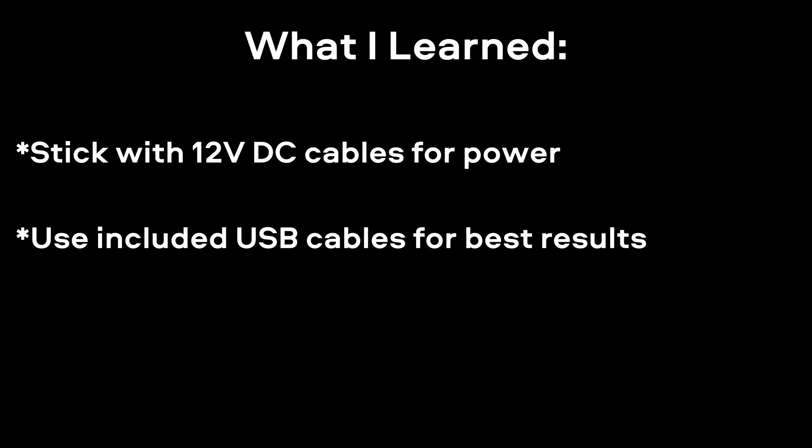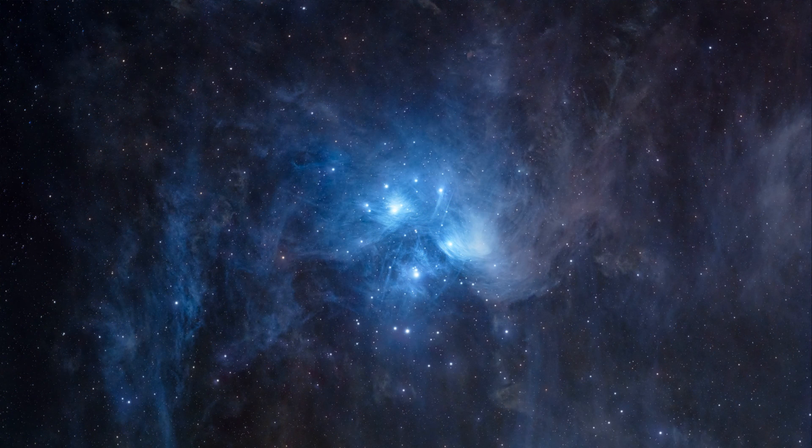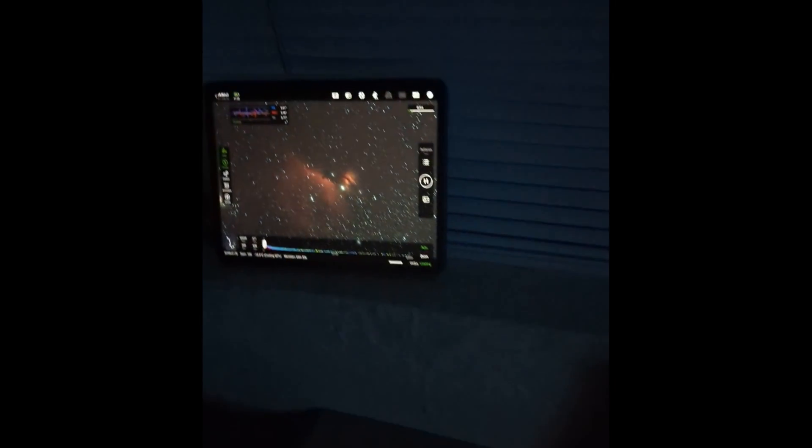So my final advice: if you're still fairly new to astrophotography, try to get at least four hours on your target, even if that takes two or three nights to accomplish. More is always better, but that's a topic for a separate video. The big takeaway for me was swapping out AC adapters for straight 12V DC cables — that should give you much better results. Also make sure your USB 3.0 cables are legitimate and from the manufacturer so you know they work as intended. If you're still noticing problems, try swapping the cable out. And if you want to make your life easier and can afford it, consider getting the AM5, ASI Air, a dedicated astro camera, and a telescope — with a little practice you'll get vastly improved images over DSLRs, and for most of the night you can just sit inside and check the iPad anytime.